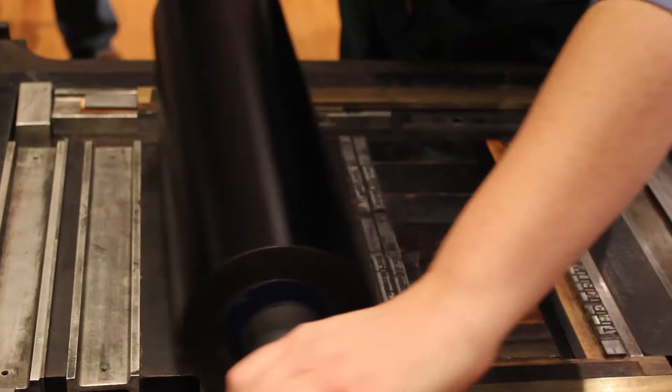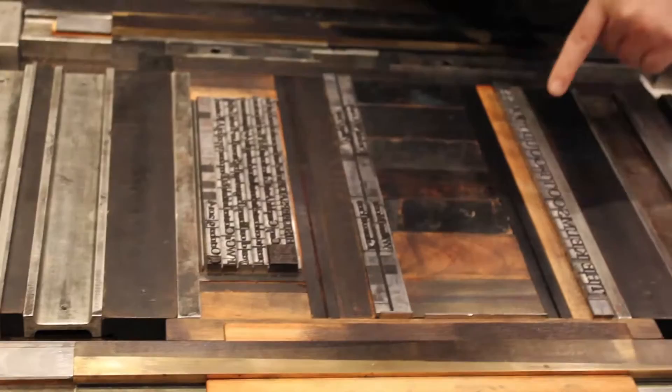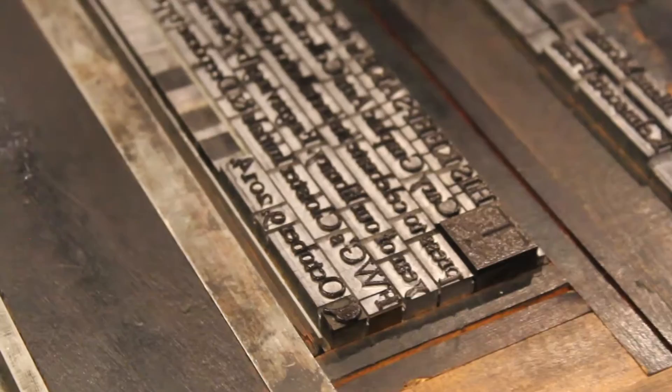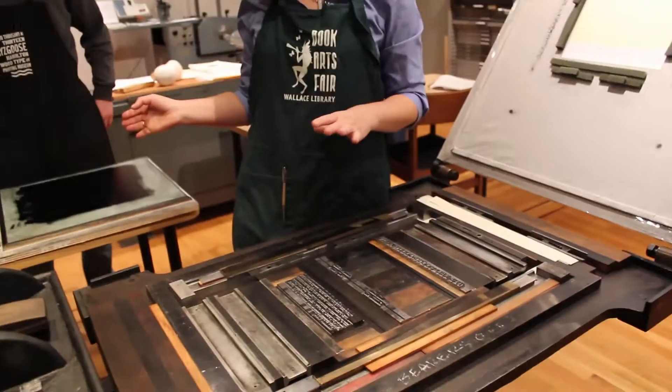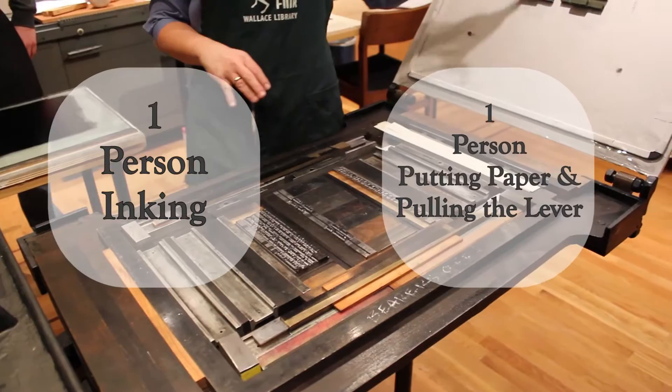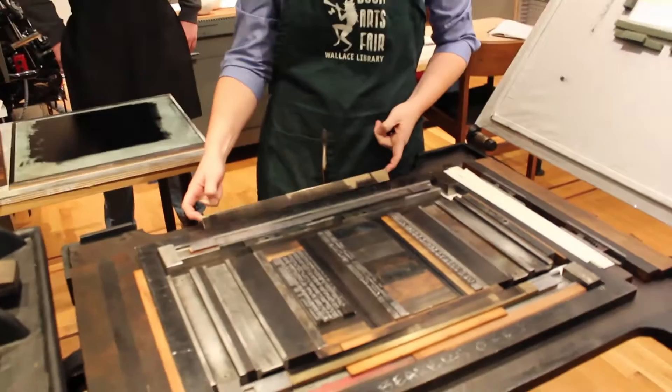You come once this way, resting on the bearers, then turn around and come once this way. I can see immediately that everything has been inked on the first pass, so we are at the right level to just give it a kiss of ink. These particular presses were always run by two people: one responsible for inking, and the other for putting the paper on the press and pulling the lever. I'm going to be the paper handler with the clean hands, and Kevin is going to be the inker with the dirty hands. His job will also be to remove the little bearer strips so we don't print them.